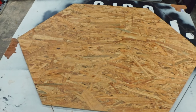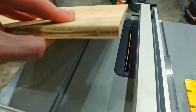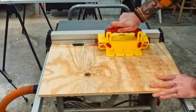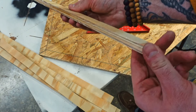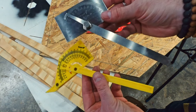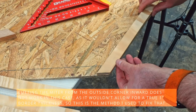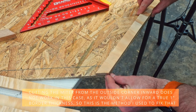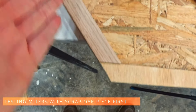We've got our shape for the outside edge, so now I can map out the one-inch border around the perimeter. For the plywood on the outside frame — this is half-inch thick — we're just going to be cutting some one-inch wide strips. Starting to assemble this frame: I have those one-inch pieces cut on the table saw, long enough to overhang with plenty of excess. I started by testing the angle to see if I could do a mitered corner, putting it down, extending it out to the side flush, and running the next piece all the way into it — you can see it flows nicely into the other piece.